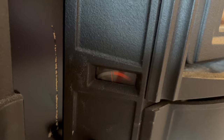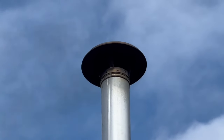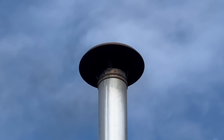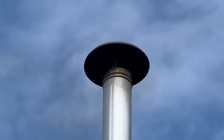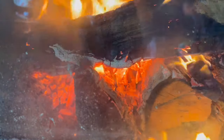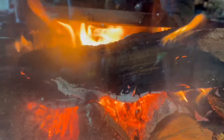We're 20 minutes in and almost ready to push that in. Let's check the flue — we're pretty clean, just a tiny touch of smoke. Give it another few minutes and even that'll disappear and it'll just be heat. Right before we push the bypass in, with this mid-level technique I've got coals in the bottom, wood that's ready for fuel, and wood on fire that's still intact, burning really well and making it nice and hot.